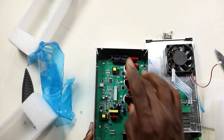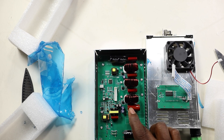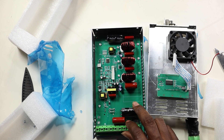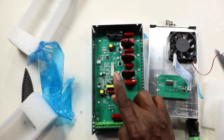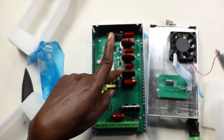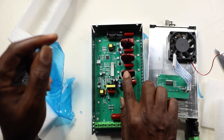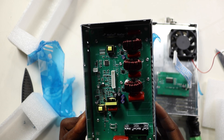The MPPT uses a specialized system and technology — there are capacitors, special transformers, and other components inside. It converts the power coming in from the panels. Here is where you can add more panels in series. This unit can handle up to a maximum of 160 volts, so make sure your series connections do not surpass that maximum voltage. If needed, add panels in parallel so you don't exceed it. They are also rated for the amount of wattage they can carry in different voltage configurations.